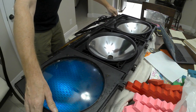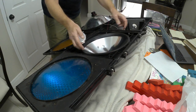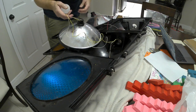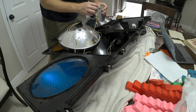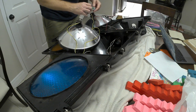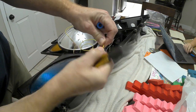Here I'm doing an assessment on the wiring. The colors aren't always standard in these traffic signals, and some of the wires had been broken off — whether from using it for another project, breaking off over time, or debris hitting it. On these controllers it works a little differently than you're used to: the positives are common and the negative is the switch side. So I'm identifying which ones go into the common positive and stripping off a little more than an eighth of an inch for each connector.